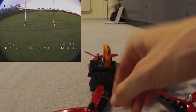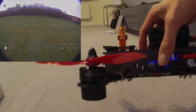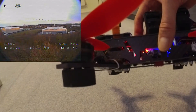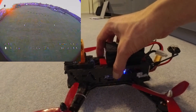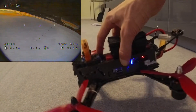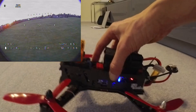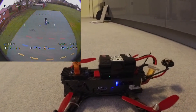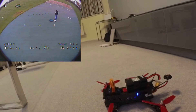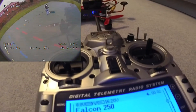The final thing I've done is remove the motor angle mounts, so I can enable angle mode and it works okay. Whereas when it was angled at 10 degrees it was always drifting forward and basically made it impossible to land. So that's a lot better — I'd recommend doing that mod. Okay, that's it, thanks for watching.